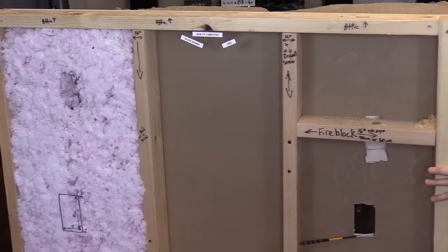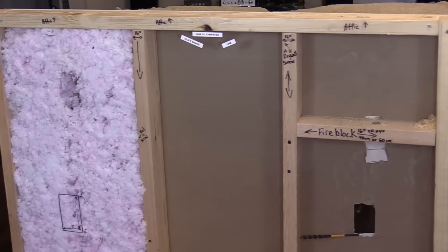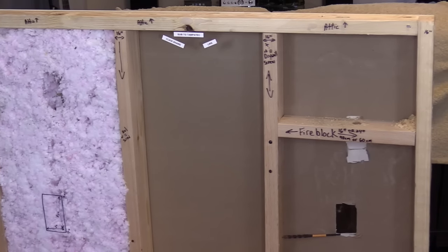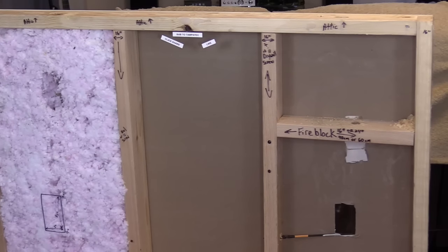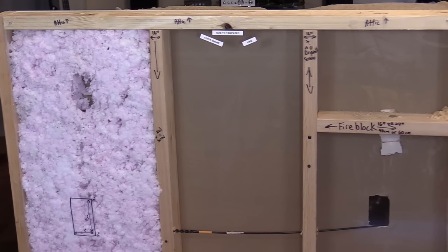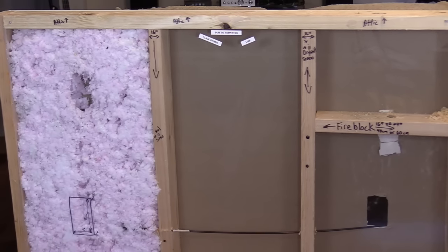You want to switch it to drill mode. I'm going to put my flex bit and rest it on the bottom of the drywall access hole, and then I'm going to start drilling right here where I can see. Because it has a screw tip, it's going to bite into there really easy. I'm going to press the trigger on the drill real slow and walk it all the way to the other end, and then start drilling once it bites in.